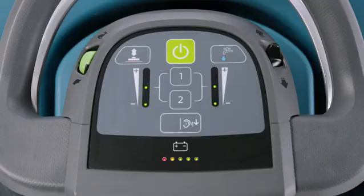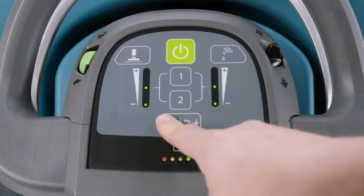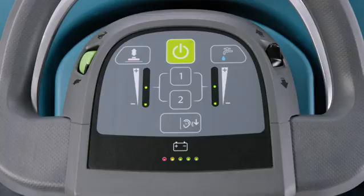If you're using EC Water Nano Clean and need to clean really tough soils, you can activate the optional Severe Environment switch by pressing this button for a 30-second dose of detergent to clean in small areas. The green light blinks slowly at first, then rapidly for the last 5 seconds of the dose. To turn on a continuous flow of detergent, press and hold the button for 2 seconds until the light stays on without blinking. Press the button again to turn off the function. If the indicator light is blue and blinking, the detergent tank is empty.